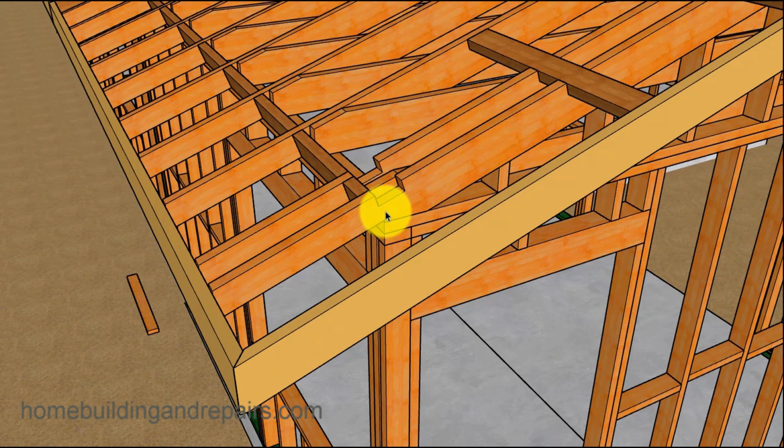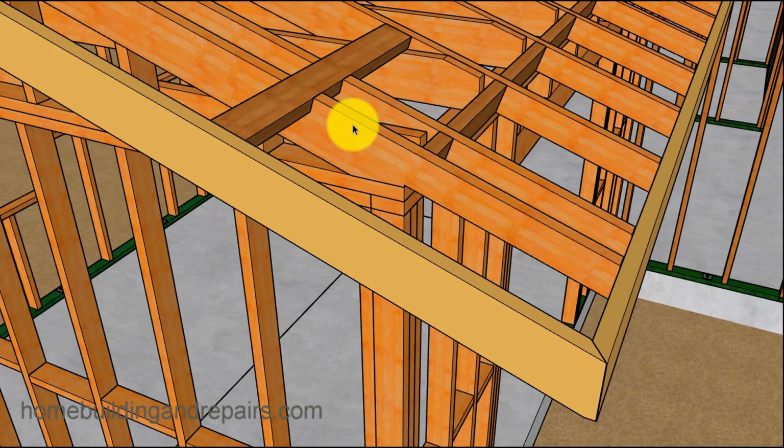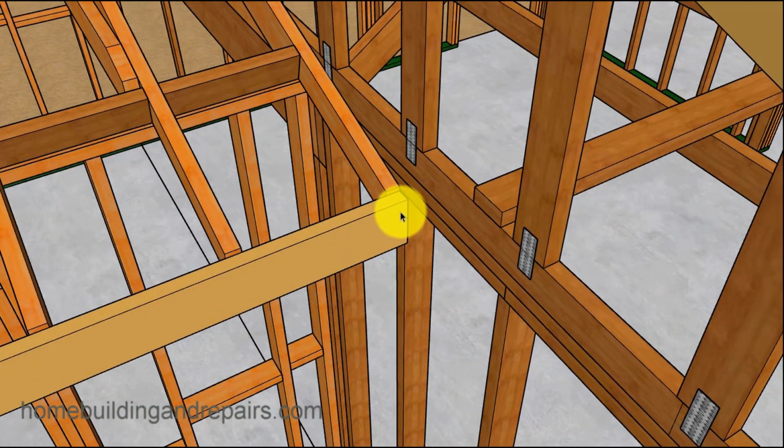If it was to break, you were using roof tile, for example, and longer overhangs. Let's just say that I had a 30-inch overhang or a 3-foot overhang, and then here I had this going out 24 inches. Something like this would definitely be a problem. If the fascia board was back about 12 inches, and the fascia board here was even with, it was basically just 1.5 inches overhang, maybe with a 3/4 inch spacer between the fascia board and the roof rafter, then it might not be a problem. So here's one way to look at it. If I take and move the lookout up a little bit, then I got a lot stronger section of the roof there. And then the fascia board here butts in.